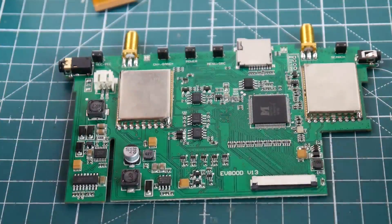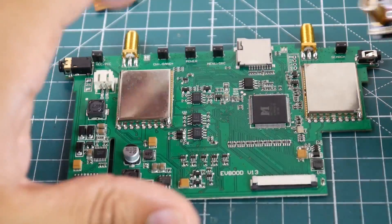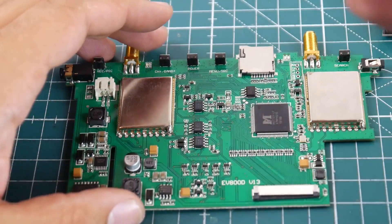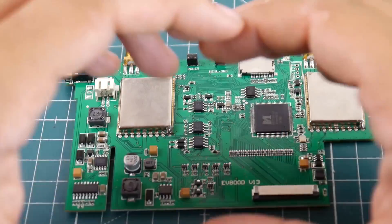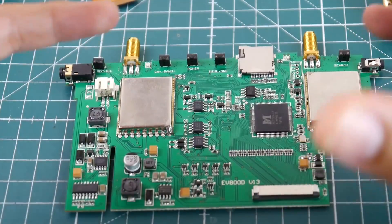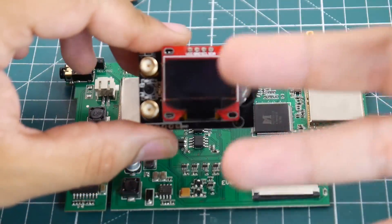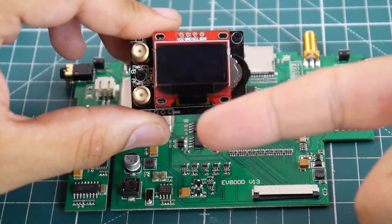Some people didn't like that, so that's what we're going to do differently here. A couple of things to take note of: this one comes with a 7.4 volt battery, which is a 2S battery. So there has to be somewhere around 5 volts on this board because the Fatshark modules take 5 volts. And all we need are three wires: video, ground, and power.